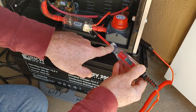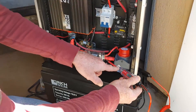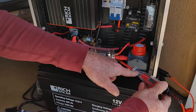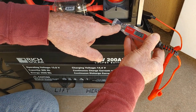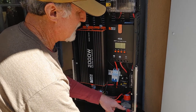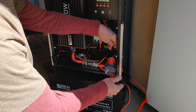Okay, so 11 — it's going down. I'm just going to wait for it to kind of stop there. It's basically pre-charging those capacitors in the sine wave inverter. Now it's going down a little bit more. Yeah, it's about close to evening out there, I think. So I'm going to go ahead and turn the switch on, and that will give power to the whole thing.